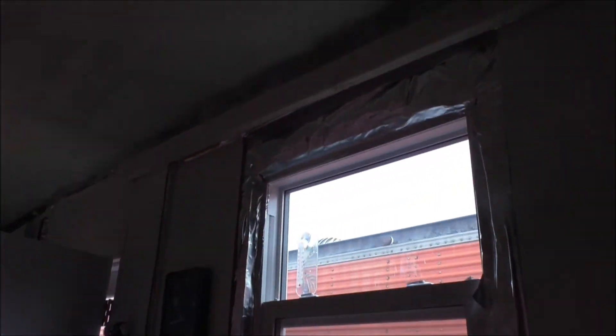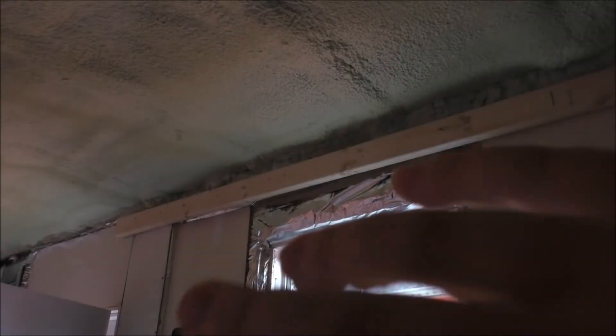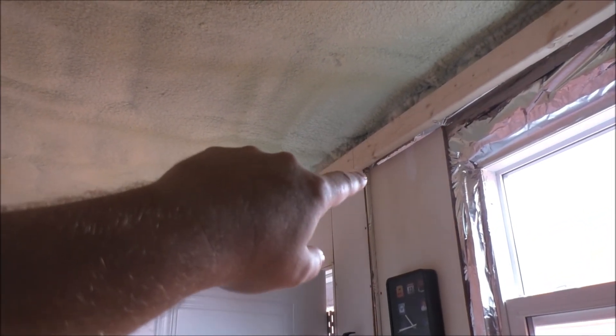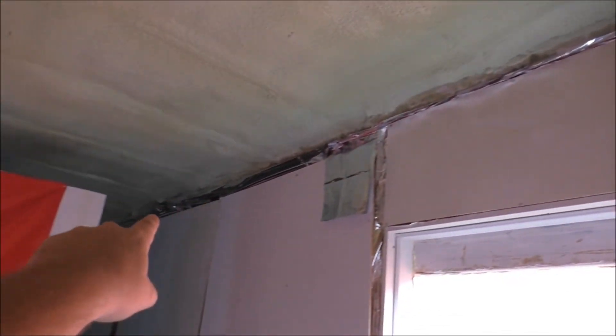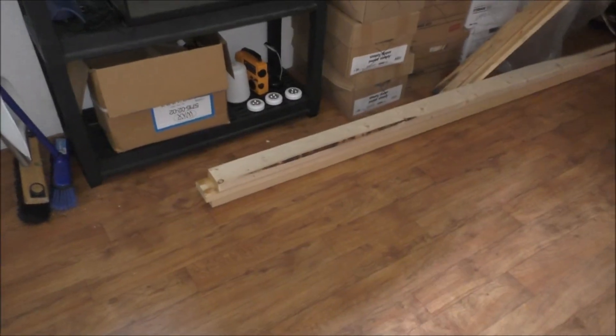On to the videos, guys. I'm going to start pulling this lumber down, take it outside, and cut it. I probably won't film me pulling this down and cutting it - I'll just film me putting it back in, and then continuing on. Once I get down and flush into this side of the wall, I'll put another piece along this side and continue on. And what that will do - which is really good - will help hold this plywood in tight to the wall where I want it. Dual purpose again, multi-purpose awesomeness. I'll put a full-length 8-footer, and that's probably about 8 feet, probably get to the wall. And I think I have over-purchased 2x4s - I've purchased too many. I got 3 left, so I can always use extra lumber for different projects.